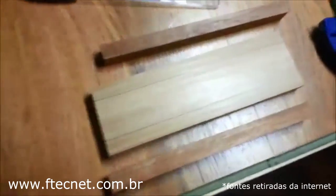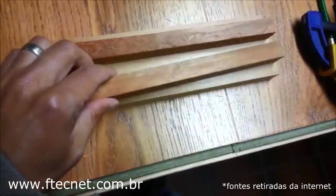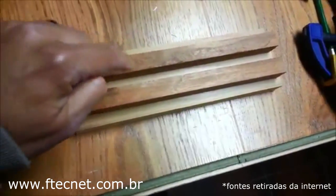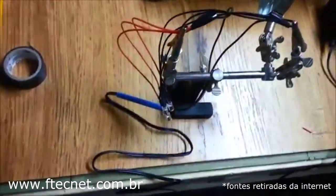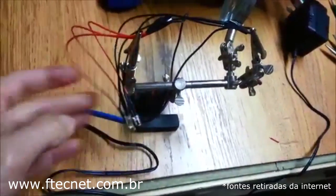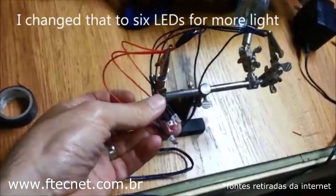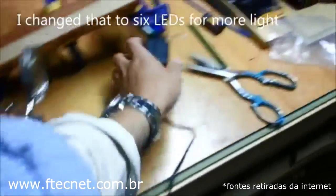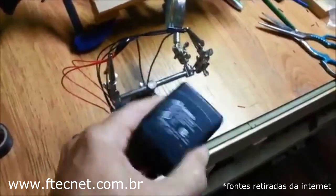A simple base — that'll be glued there, and this will be glued there, and then we'll put some holes for some red LEDs. Some fast, simple wiring. I'm going to use three red LEDs. For the power source, these are 12-volt LEDs but they run fine on 9 volts. So I went through the junk bin and pulled out an old wall supply that would kick out 9 volts.